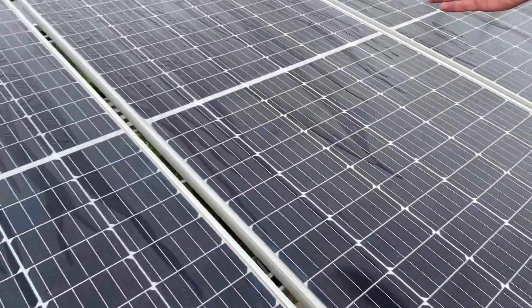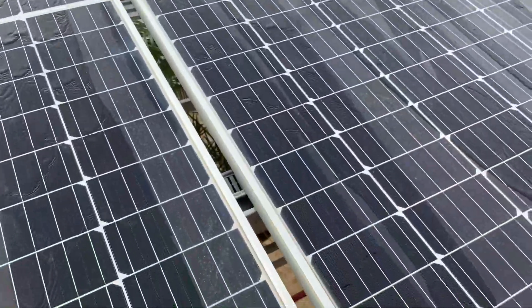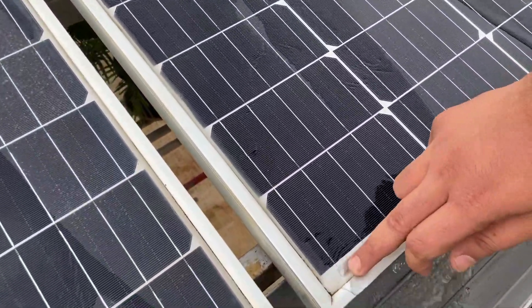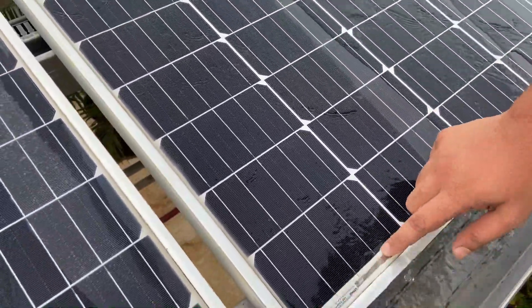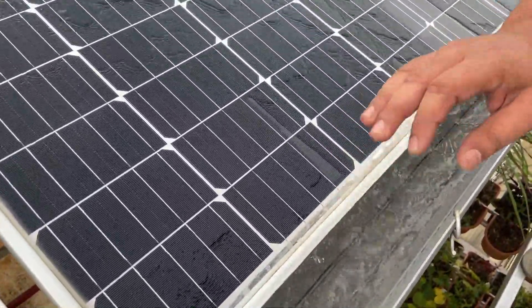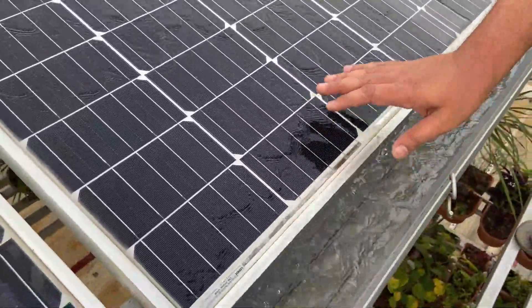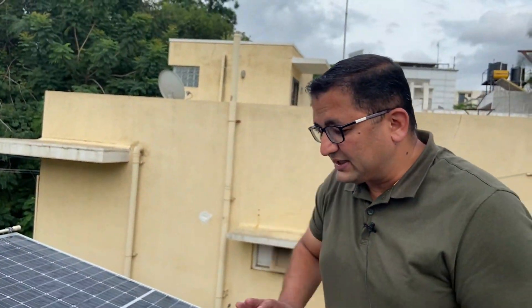You can see here the water is coming down. As the water comes down, it will settle here. This is the portion where the water will wash off the dust and then settle. The settling of this water can result in a lot of dust and over a course of time can lead to discolouration of the solar glass.